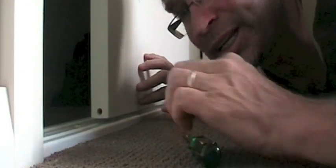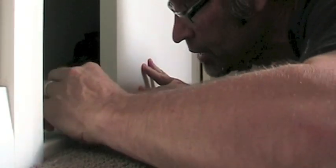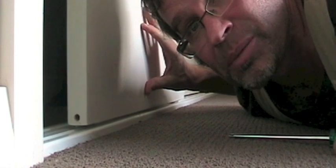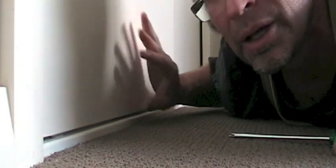Let's just open this door up a little bit so I can access the adjusting hole. Putting a screwdriver in, find the spot, go lefty-loosey, anti-clockwise. I reckon that'll be just about right. Let's check it out. Give her a close - and it is touching at the bottom and touching at the top. Beautiful. There's a bit of a gap in the middle, but that'll be from a bend in the door jamb itself.